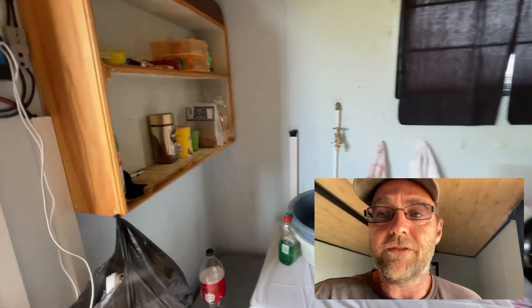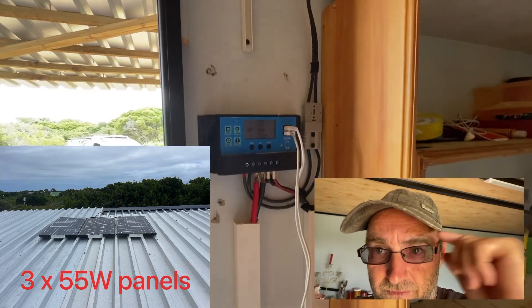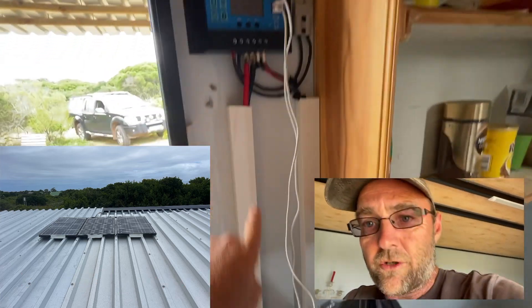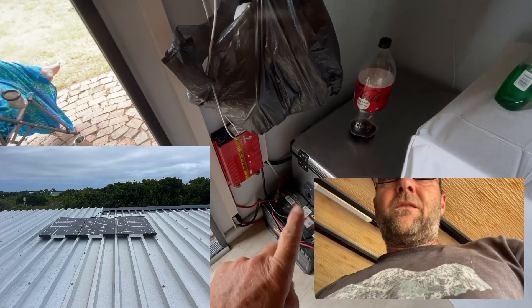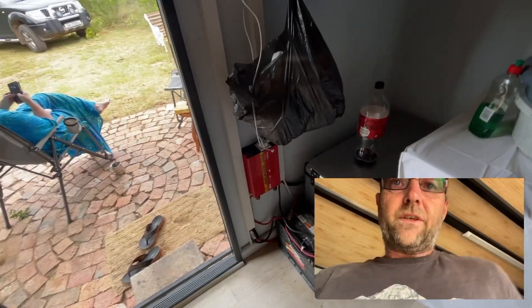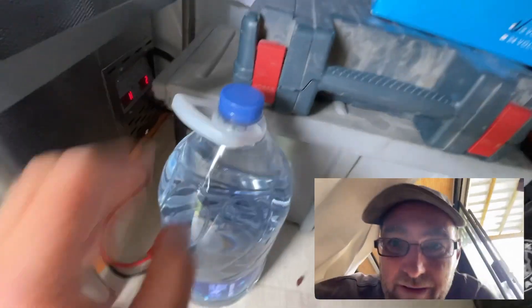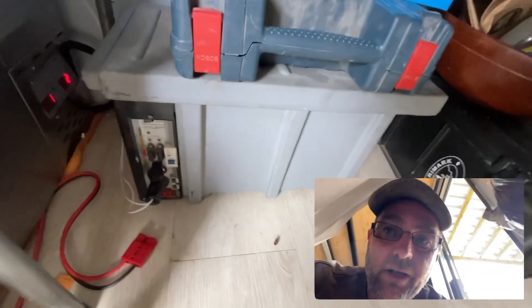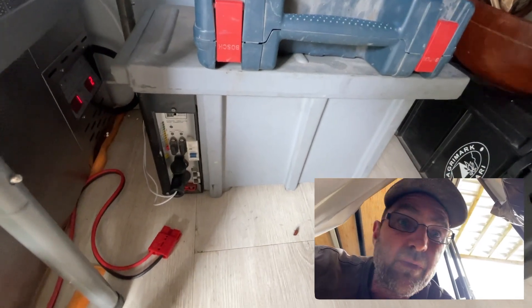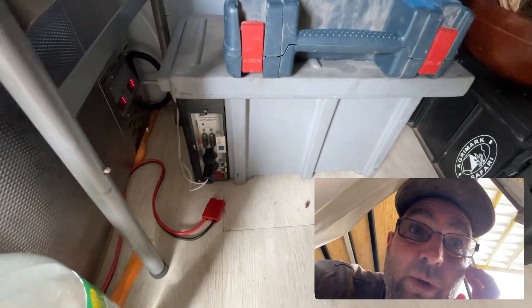We installed the solar system when I came down. We've got solar panels running down into the controller, from the controller down into a battery. I've got a small inverter just to charge up electrical equipment, computers and stuff like that. From the battery I have a secondary battery underneath here which comes out of my vehicle, but I only use it for the lights. I use a charger from the other battery when we have full sun — we get 14 volts off the panels.